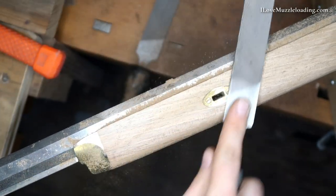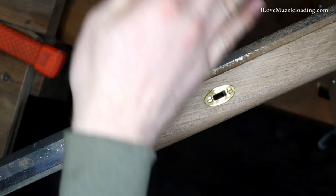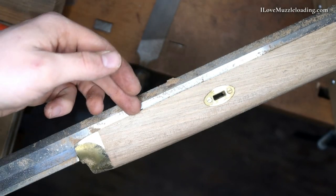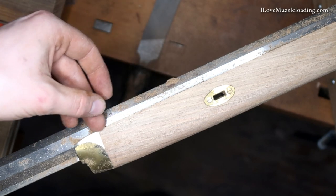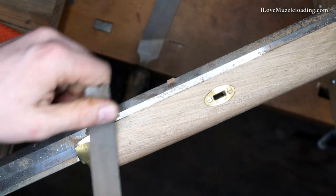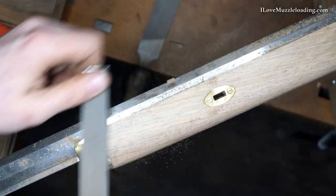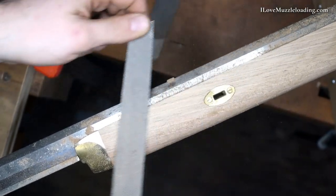My goal is to bring this curve up and around from the bottom of the stock, line up and be nice and thin up here. I want this line here between the barrel and the stock — I want that stock to be like a sixteenth of an inch thick as it comes up and approaches this barrel, and get wider as it comes around. That's just what I try to go for — it's what I've seen in other kits, other builds, and original pieces as well.